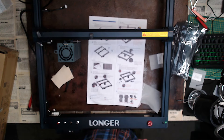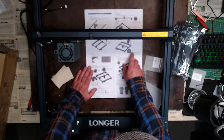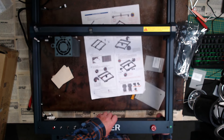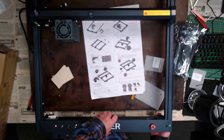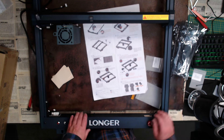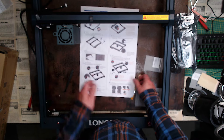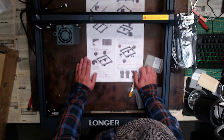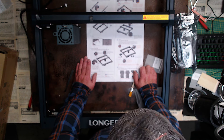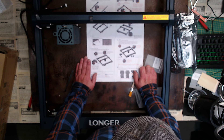What is next? Looking at this: limit switches are done, we've done that. Before using the laser engraver, make sure you level it up on the bench. These have adjustable feet — the RAISE 5 doesn't have adjustable feet. These ones have little twisty adjustable feet, which is very good. You can unscrew and screw these feet on the bottom. There's also a little bit of birch ply for practice. We're now on step six.